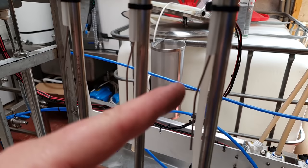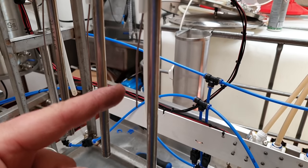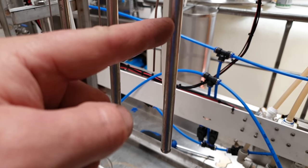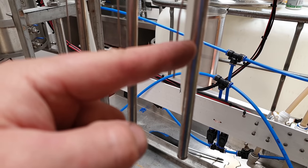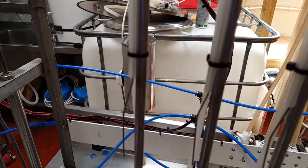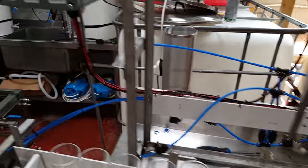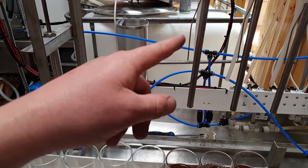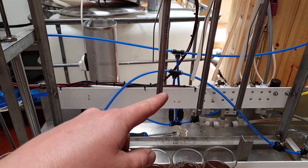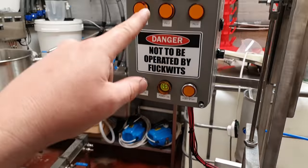The probes come out slightly at the bottom just to give a gap so any bubbles that form will break before reaching the probe itself. We've got 5 volts on the fill tube, which is coupled across all of them, and ground on the sensor — the sensor has to be ground and the chassis has to be 5 volts. That's the way we've wired it up.